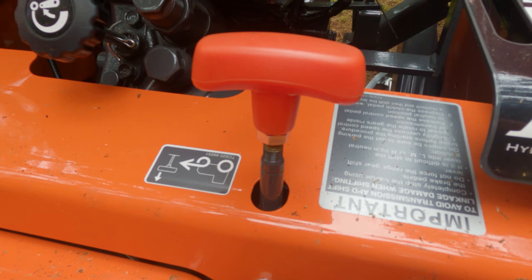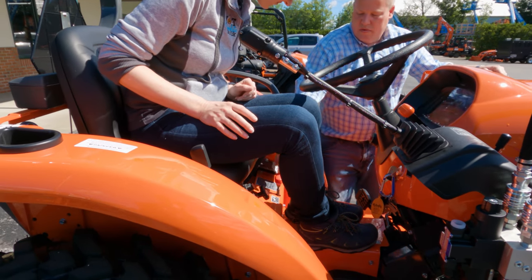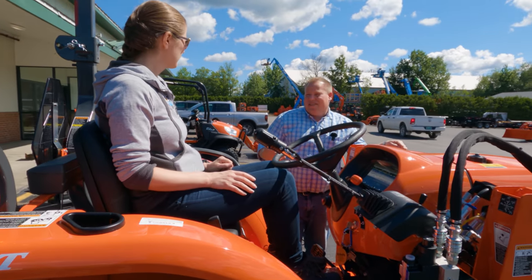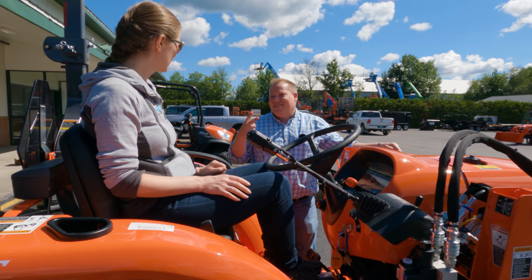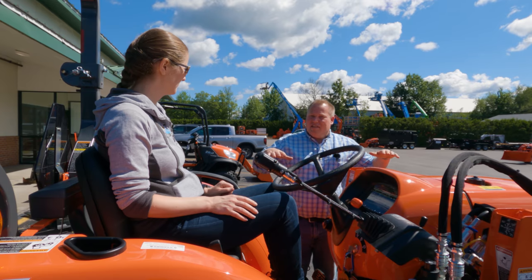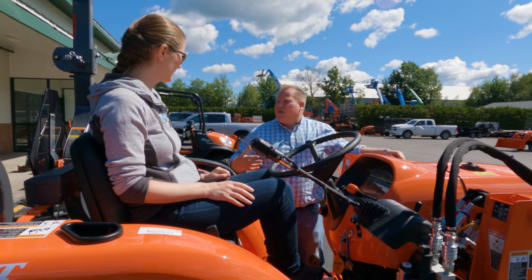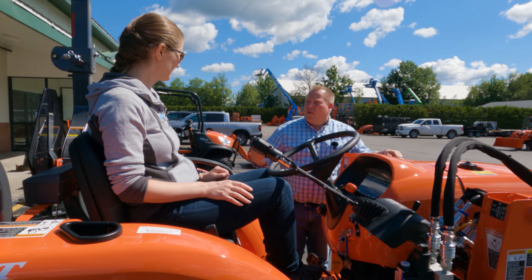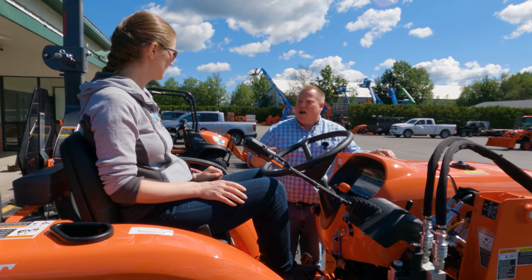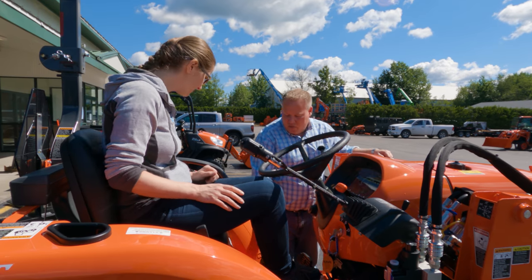When you're in four-wheel drive you're really in two-wheel — four-wheel drive is just one back tire and one front tire and it's a limited slip looking for least resistance. It works great if you just need a little more traction in snow. If you're going to be in the woods, maybe you want four-wheel drive for a little more traction. But what I really like to use a lot is right here — this foot lever is what's called a locking rear differential.